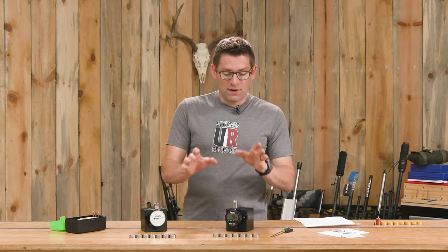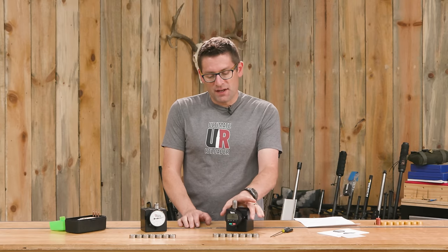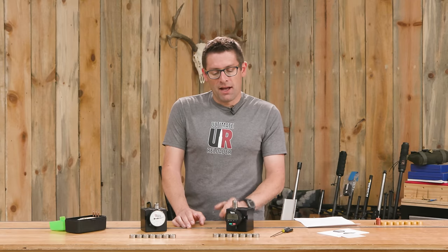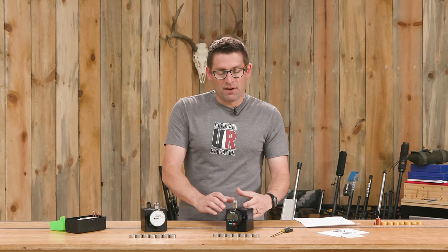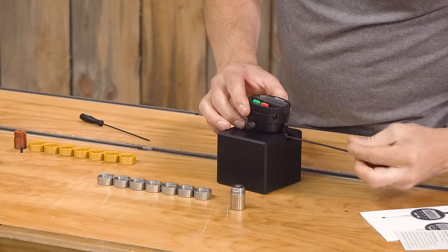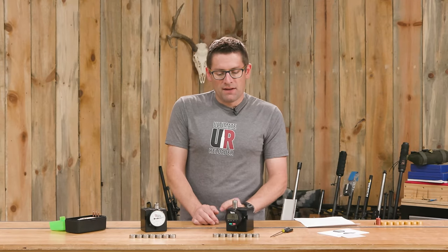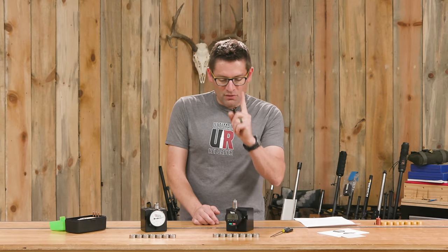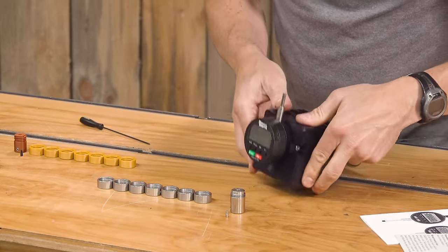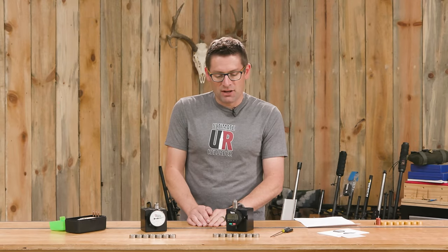PrimeWare setup is really easy. I've got the base in both cases here. There's a single screw on the side that pulls a clamp together. You're going to want to put the base on its back, get the dial indicator centered within the clamp — the clamp slides in a track side to side — then point the indicator needle true north and gently tighten that down. You can then turn the base up into its vertical orientation. This is how we're going to use it.